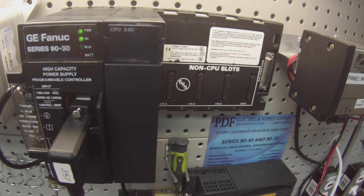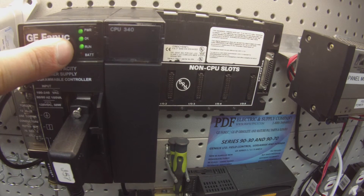The idea of the test is that if the processor is unable to go into run mode then it's not a working processor. Now it's asking me if I want to start the controller and enable the outputs, and I do, so I click yes. Now you see that it goes into run mode — that's the other LED that we're looking for.